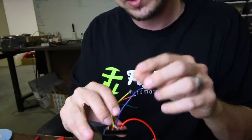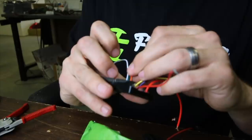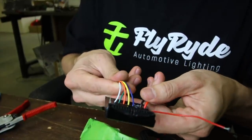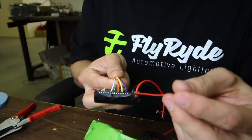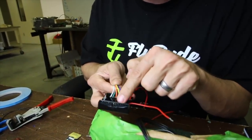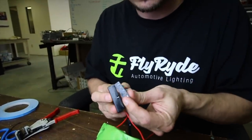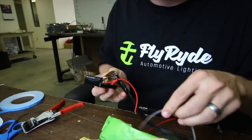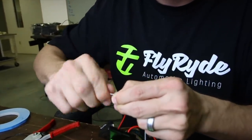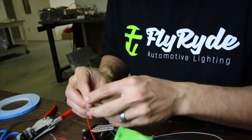Now I've got the wires that are coming into this. At the very bottom, we have our power and ground wires at the corner of the ghost module. The next wire is the brake wire input — so when this thing gets power, it's going to think the brakes are on and make an animation to show that. Next wire, yellow, is for turn signal. Then we have show mode one, show mode two, and lastly the running light. All of these inputs are what we soldered onto the ghost board before we potted them. We also have an output wire that sends voltage directly back out to power up our LEDs, and then all those little connections are the ground connection sent out to each LED to control it.